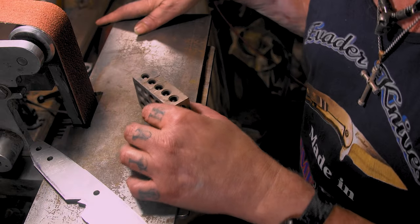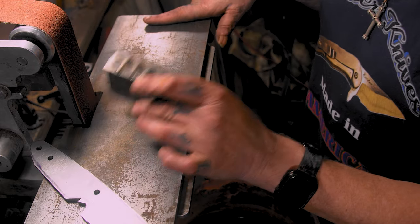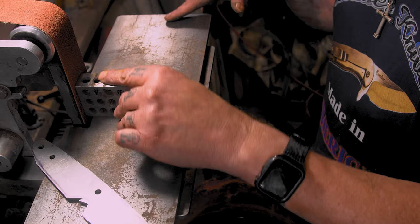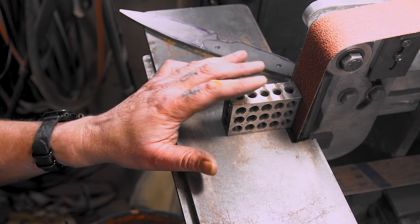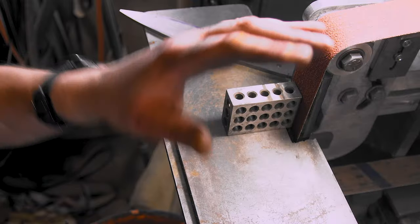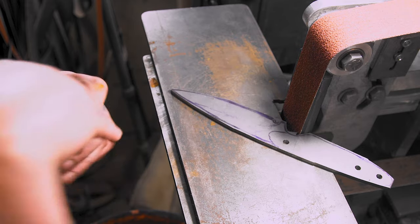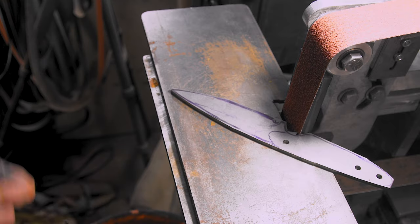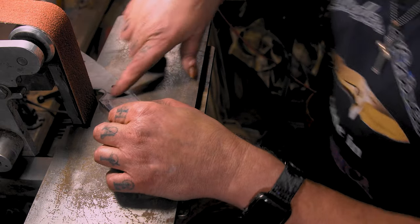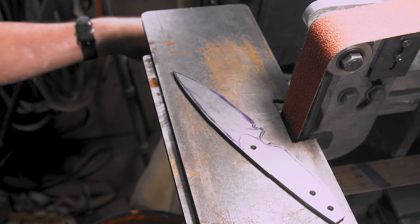If you're new to my channel, you don't know, but I use 1-2-3 blocks for everything. If you watched the last video, I used them for drilling. This is all you need to set up a tool rest — if your tool rest pivots back and forth, your one-two-three is square. See, boom, we're good to go. Get 1-2-3 blocks — buy one or two every month until you have them everywhere. Look at my shop, they're on every tool. So I'm going to see if we can try this and get in here, and then I'll show you what to do. Little spaces like this — what I do is I hang my belt over so there's flexibility in there.